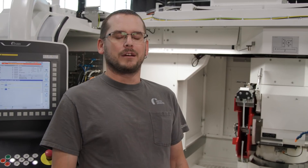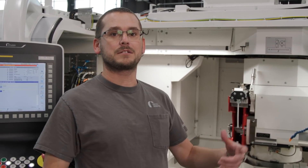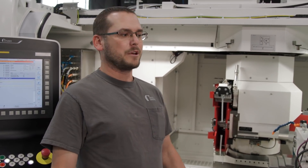In the world of grinding, we have machines that are equipped with oil as a coolant medium. When you have a grinding wheel that's spinning fast, it always creates mist inside the machine, which in the worst case is flammable. That's why we at United Grinding make sure we always equip our machines with a fire suppression system. And after we got the machine in here at Titans of CNC in Texas, we make sure to test the system for correct function.